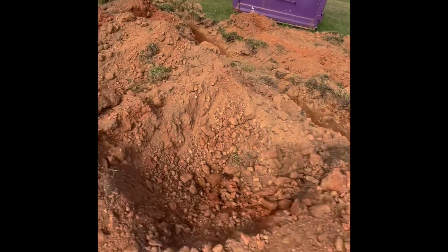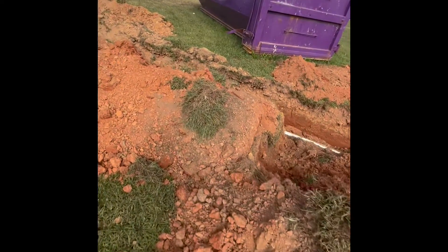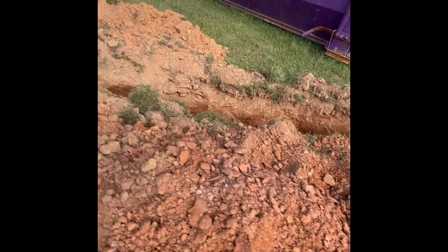They'll go inside and cap the four-inch pipe, then fill the drains up inside to make sure there are no leaks. That shows you how to hook into an existing septic tank — they found it, located it, trenched from the home into the tank, and now everything should be running and falling properly. Thank you for watching my videos, hope you come back and watch more!